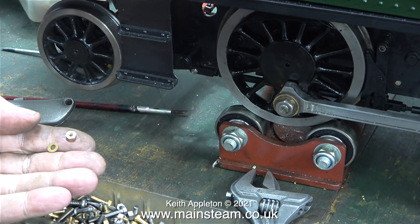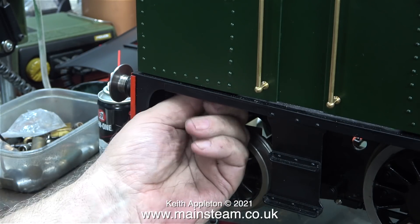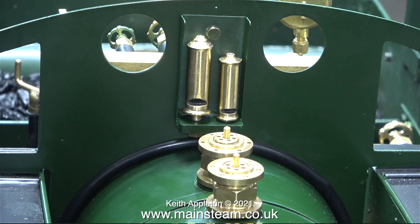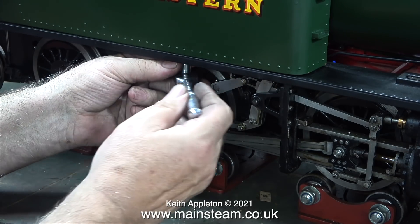The next job is very simple — I'm going to bolt the superstructure to the running boards using four brass 4BA nuts with washers. Before doing that, I needed to make this black combing, which holds the boiler in position. The superstructure is fully bolted down onto the running boards, and this puts a positive pressure on the top of the boiler over where it sits on the special boiler mountings that I made and bolted to the frames. I didn't want to drill the boiler to mount the usual pieces of angle to it. A final check on the tightness of the 4BA nuts holding the superstructure to the running boards.